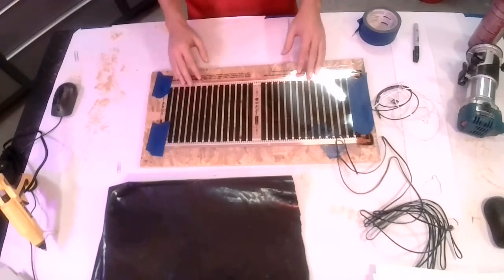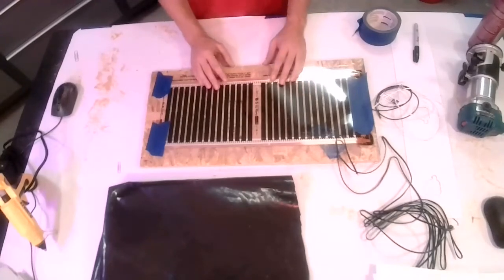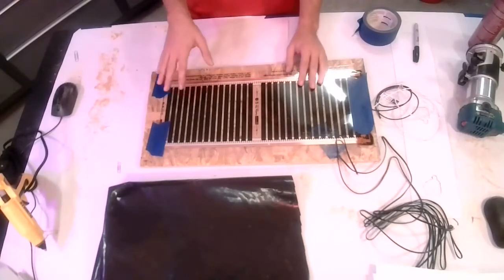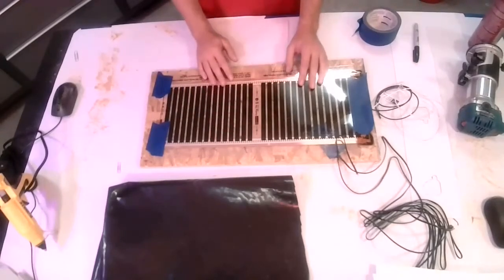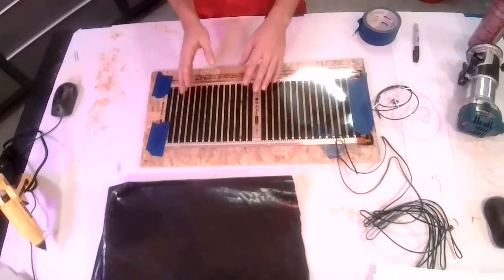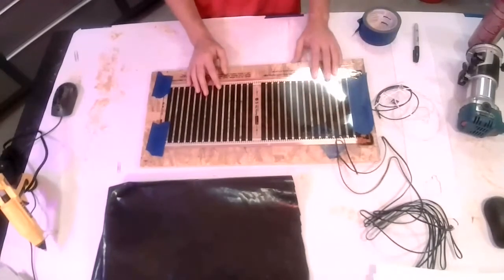And well, we can do a Gold Heat mat as small as 2 square feet. Didn't really make sense in this application. So actually on the stair runners, we used Black Gold on those. And as long as you're operating on the same voltage, it can be tied together and controlled on the same thermostat as well.